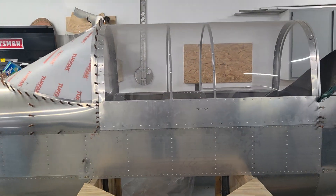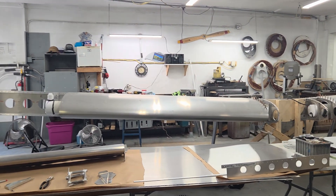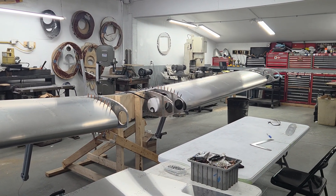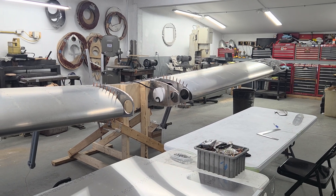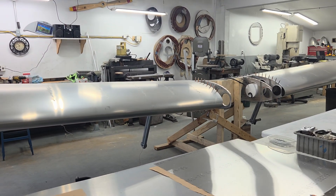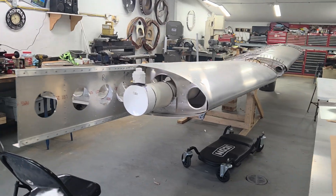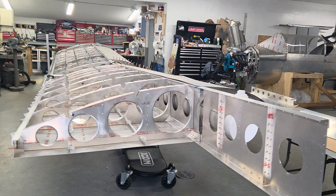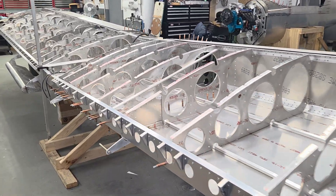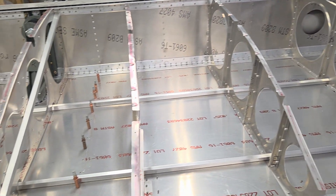This is about the height the fuselage is going to sit at — normal height, not too tall but not real close to the ground. Here's the wing sitting on its stand, which simulates how it mounts in the fuselage. It's a big wing and all one piece — this is not an airplane people are going to take apart every weekend and trailer to the airport. Like a Mooney, you pretty much put it together once and hopefully it stays together forever. There are definite benefits to a one-piece wing spar — nothing to inspect as far as attachment fittings, no extra doublers needed for bolts. Pretty typical looking construction except this airplane has extra stringers on the skins, top and bottom.